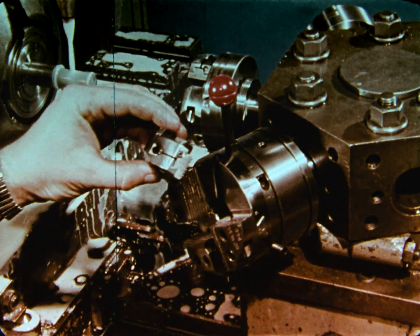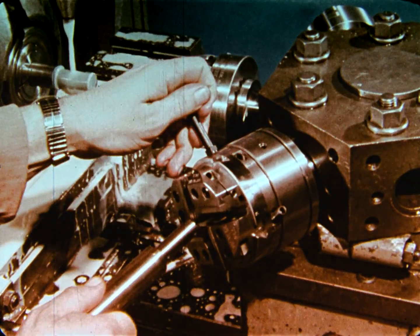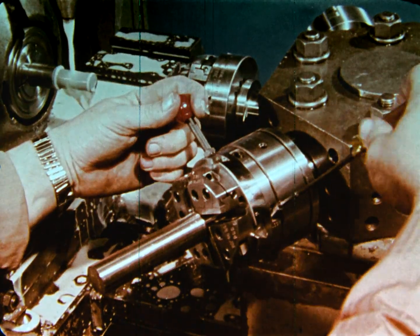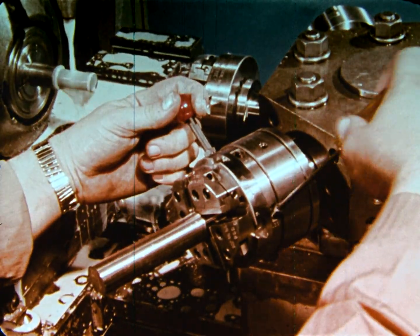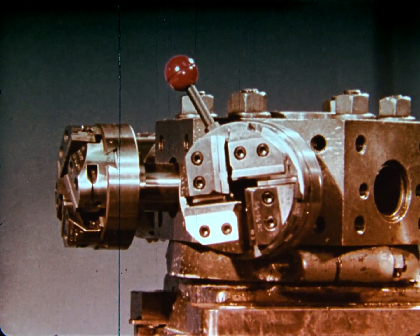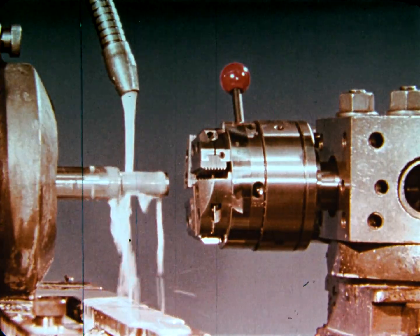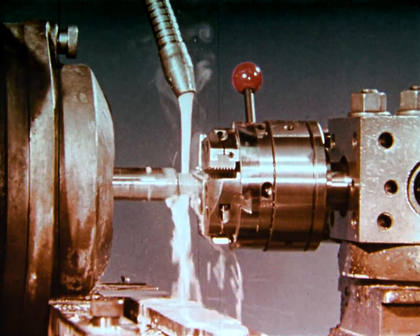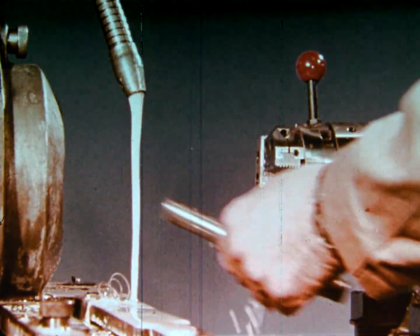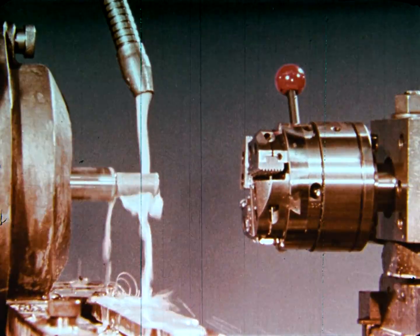Each chaser holder with its chaser is inserted into its corresponding dovetail slot. The die head is closed to cutting position. Using a threaded part or a root plug as a gauge, the die head is adjusted to cutting size by turning the adjusting screws. The machine is indexed, proper threading speed is selected, and the coolant is started. With the die head aligned using the aligning shank, the head travels forward, cutting the thread until the desired length of thread is completed. The head opens, the turret is retracted, the head is closed again, and the machine is ready to cut another thread.